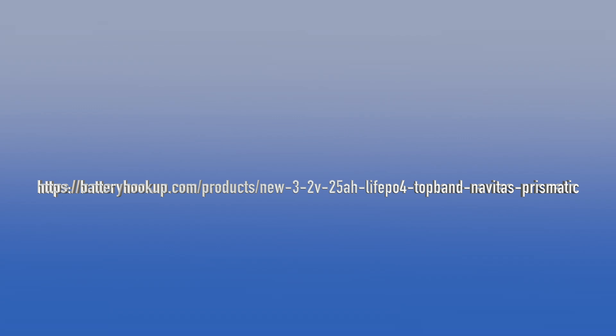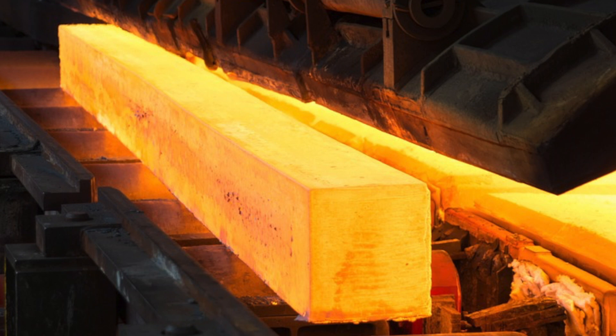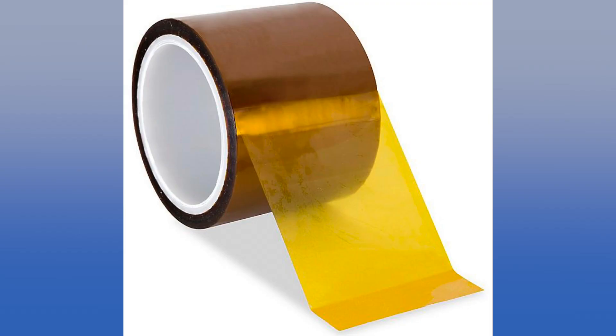The building process is actually not at all that difficult, and there's good related information on the internet. But you do have to be very careful — there's a lot of energy in these types of batteries. Accidentally dropping anything metal, such as a socket or screwdriver, into the battery terminals may create a short that can make the metal glow red within seconds and potentially set fire to something nearby. When connecting terminals, I covered the non-connected terminals with tape to prevent mishaps. I covered all the terminals with Kapton tape — K-A-P-T-O-N — on the final build for that same reason.